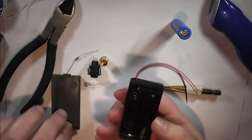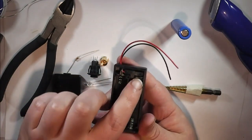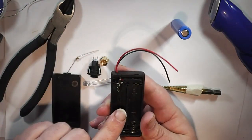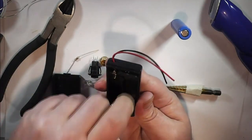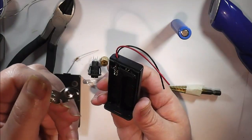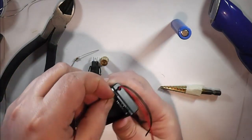And most of what you're going to do is, whereas this would be for two AA batteries, it'll be for the single battery on this side, and this side the switch and the atomizer connector will go in. Fairly simple. So the first job is to remove the connectors from the bottom, as you're not going to need that at all, but it might come in handy for replacements for anything else. So keep it to one side, and then this one at the top needs to come out.